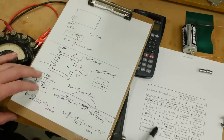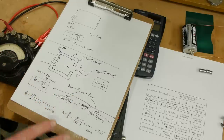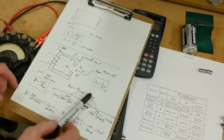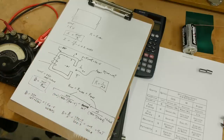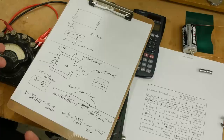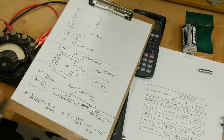We calculate the reluctance of the core (the steel part) and the reluctance of the air gap, then add them together for total reluctance. Reluctance is denoted by a stylized R, and the reluctance for any material is the length divided by the permeability times the area. This is actually exactly the same as in electronics: a thick copper wire has lower resistance, and a short copper wire also has lower resistance, even though the resistivity of copper doesn't change. Same here — if you know the permeability of your material, the length and area determine the reluctance, i.e., the total resistance to magnetic flux.